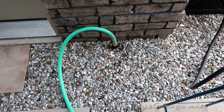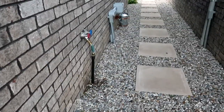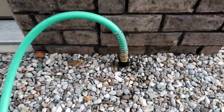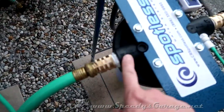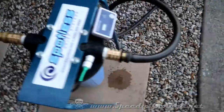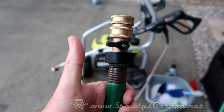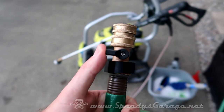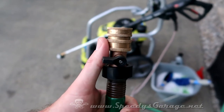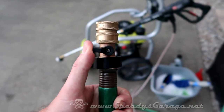Here's how you hook up the deionized filter. For me it comes from the spigot — I ran an underlying system to get a quick connect close to my hose reel. Basically it comes out of the water source, quick connect into the filter, out the other side, and to the hose reel. On the end of the garden hose I put a shut-off valve and a quick connect, so I can shut the water off at the hose end, change my tool, and turn the water back on without walking back to the spigot.